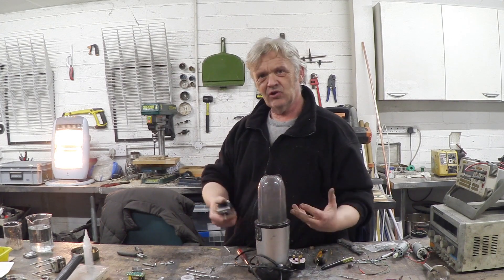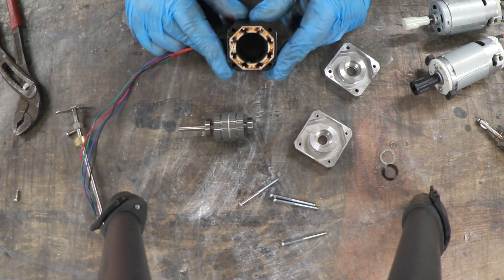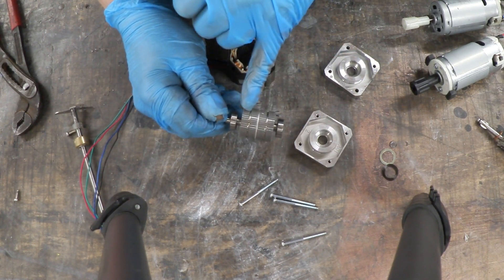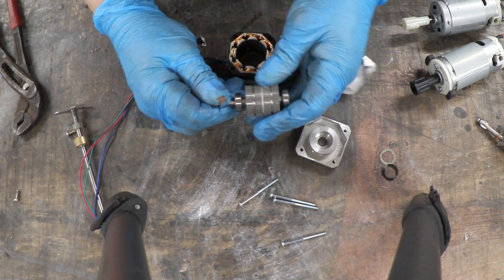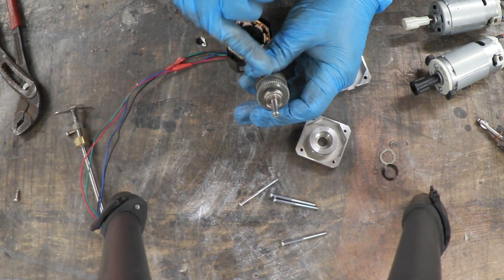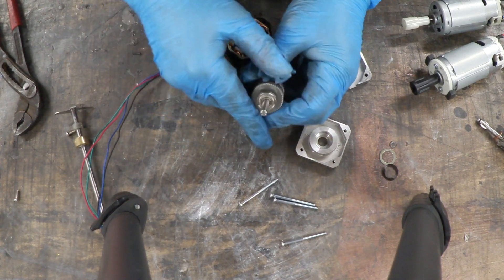Inside these is really, really interesting, so let's have a look. There it is apart. These things are beautifully made with extremely close tolerances. That's obviously the stator with its coils. Here's the rotor — it's toothed — and right there you can see two ring neodymium magnets and the end caps. What I want to do is remove these magnets, and that means drifting it out — basically hit it with a hammer — but be careful not to mushroom that end over, so put a block of wood and whack it with a hammer.